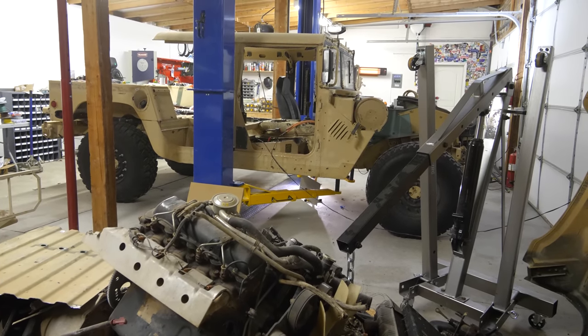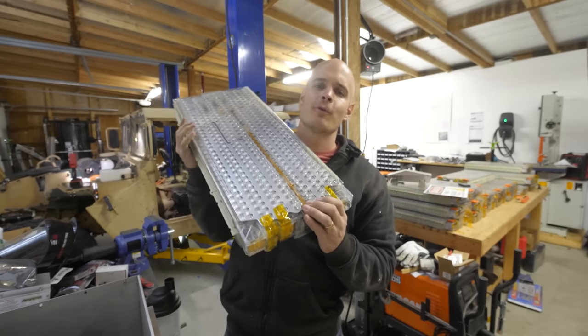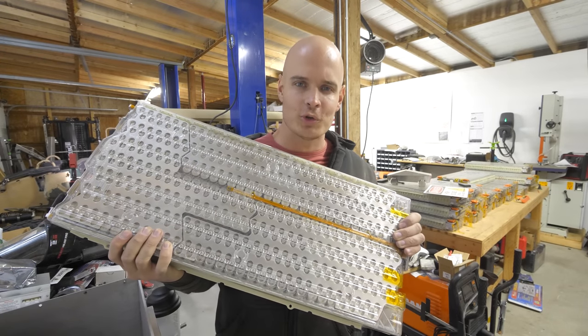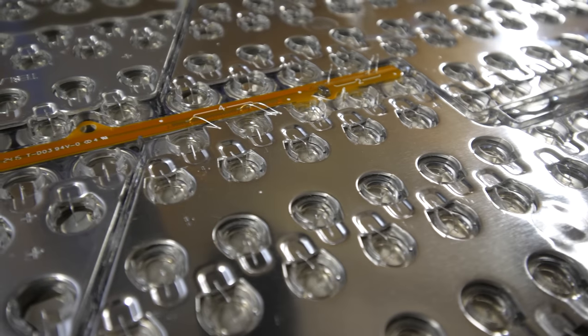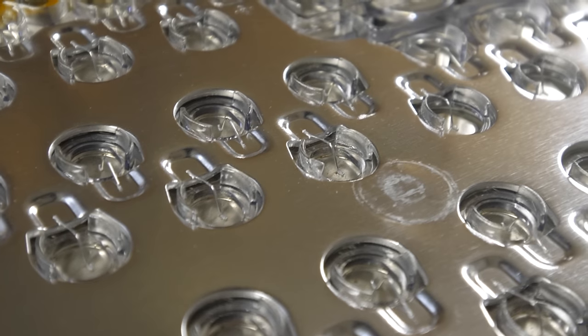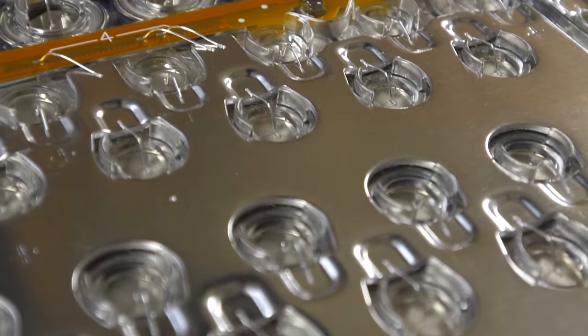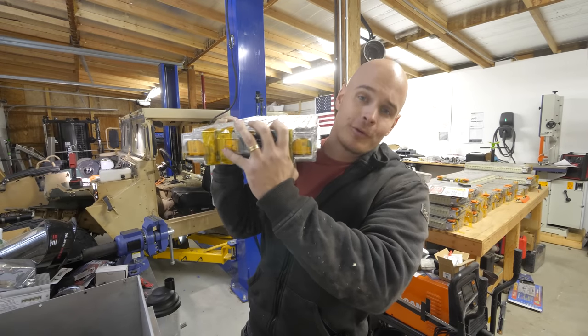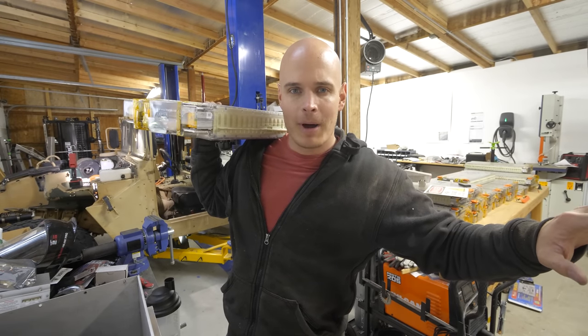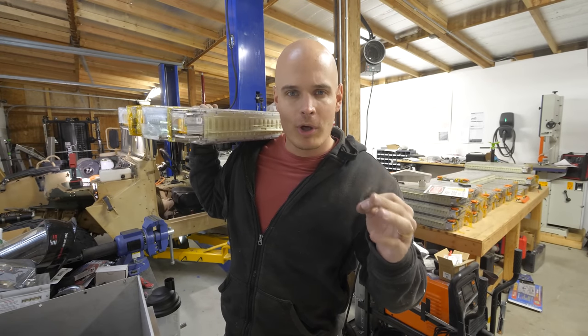The cool thing is that each one of these 444 little cells are held together with an astronomical amount of glue and metal. Plus, each one individually has a tiny little wire attaching it to the whole module. And that little wire is a fuse. So if too much current flows from that little battery for too long, the fuse breaks, separating it from the module, and helps prevent thermal runaway.